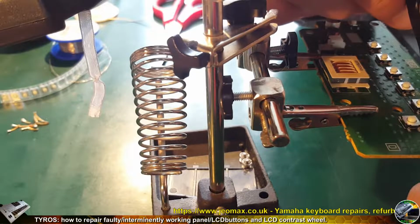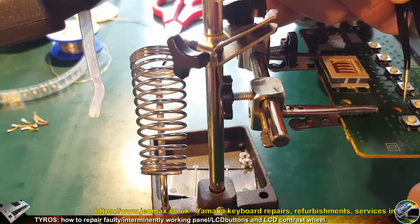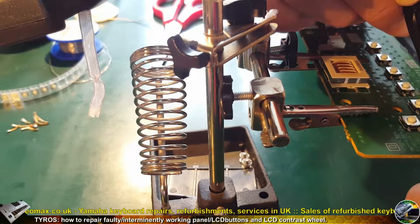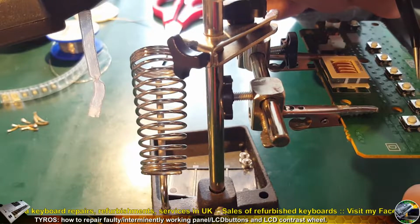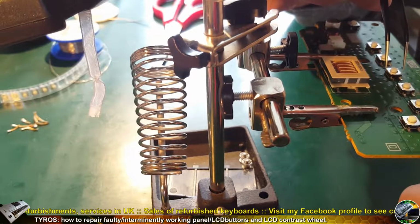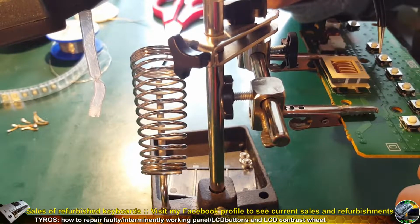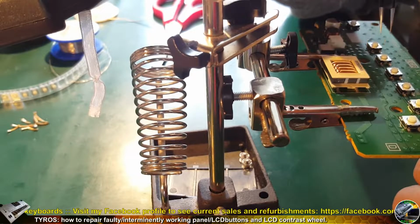So first thing I'm gonna do is to solder the first terminal, just to prevent the switch from moving on the PCB. So it's gonna be stuck perfectly to the board, which allows me either to solder in the remaining 3 terminals or correct its position again, because sometimes it happens when you hold the switch with the tweezers that its vertical position is a little bit unaligned, so it's frankly a bit higher than it should be. So you can just push it down to correct its vertical position.